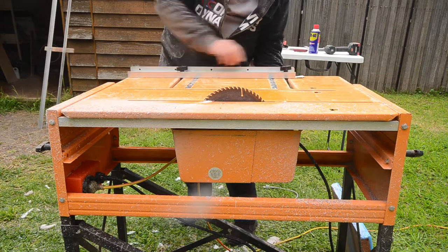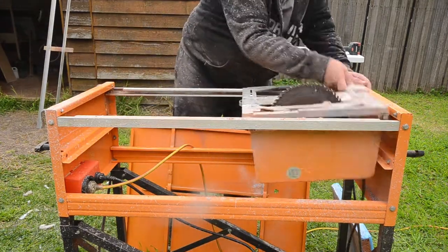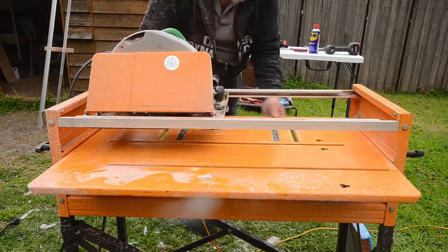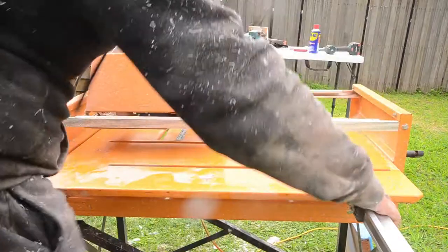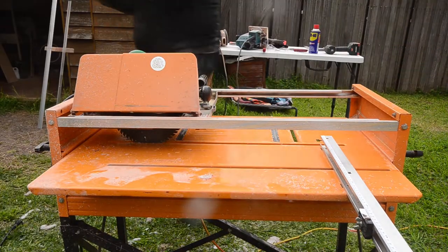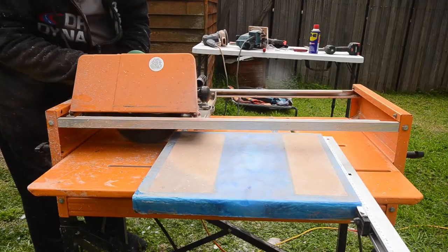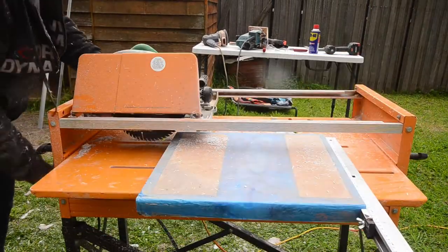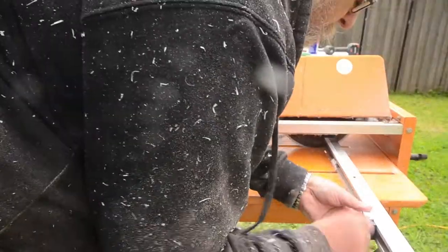Now I'm setting the Triton up in cross-cut mode. I'd previously cut two parallel edges in table saw mode, but in cross-cut mode I'm guaranteed that the edges will all be nice and square. I'm just using a fence with an end stop on it and again taking half a millimeter off at a time, just so that I can take off as little material as possible — I didn't really want to eat up too much real estate.